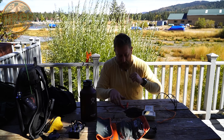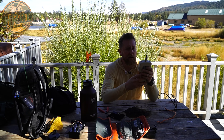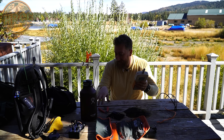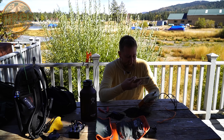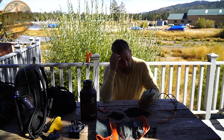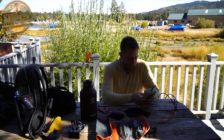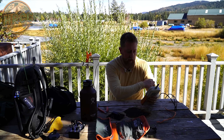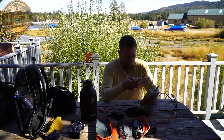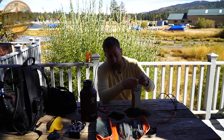Let's see how we did on the K6ARK Adam's antenna. Just attach it to the feed point like that. Let's try 40 meters. Wow — that is very impressive. The lowest point of the antenna is at 7.156 megahertz, and that lowest SWR is 1.1-to-1. That is fantastic. Sliding over to 7.075 — the FT8 frequency — it is about 1.3-to-1 SWR. That is very, very good. I'm going to take that as a good sign because I'm primarily going to use 40 meters with this antenna tonight.